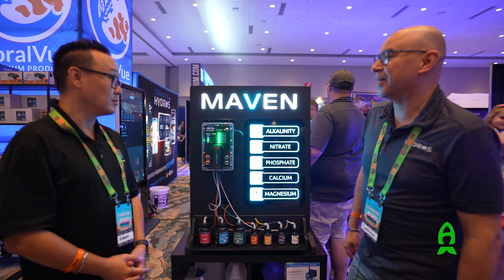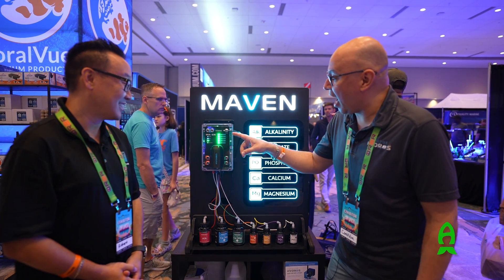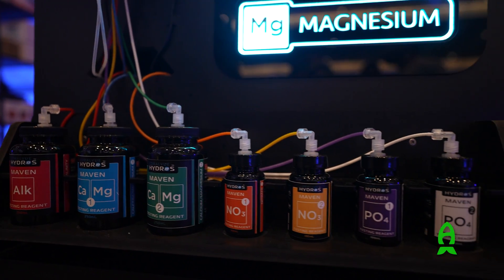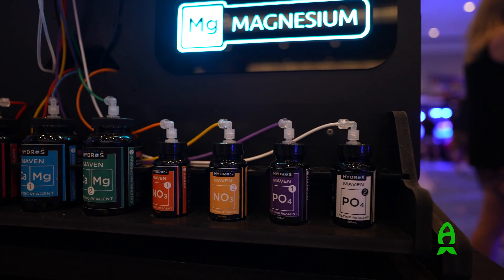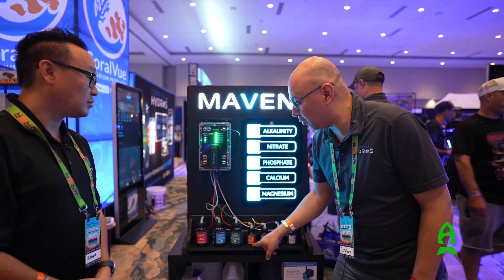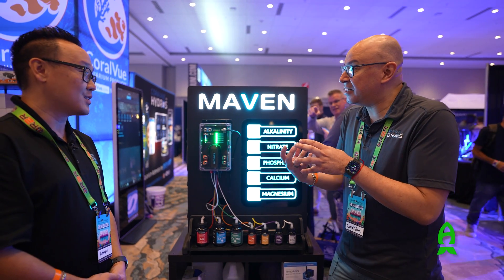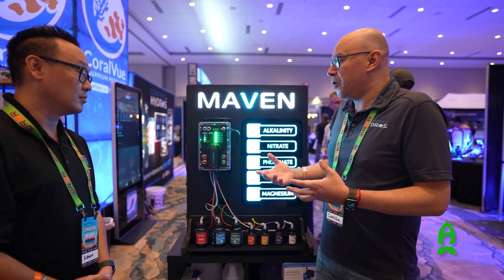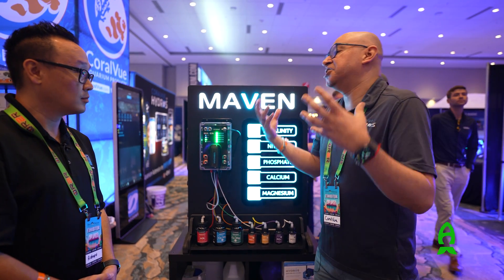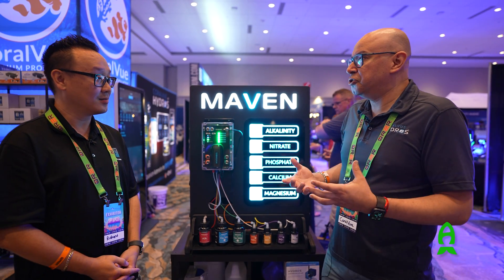And there's more. During the test, we also blow air back into the reagent bottle. So we clean the line by blowing it out, but it also agitates the reagent so it doesn't settle to the bottom. We could have used mechanical pumps to agitate, but if reagent spills the motor goes bad — and it's more expensive. Why not just use air? It's way cheaper and more reliable.